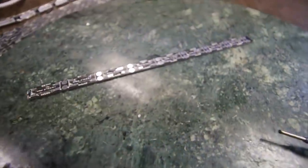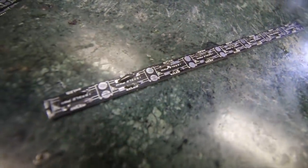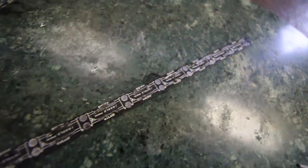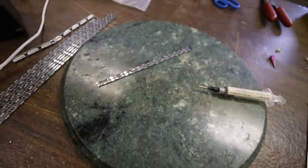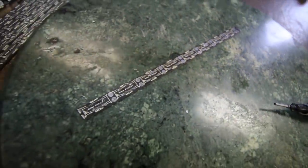You can't see super well — this isn't the best lens for fine detail — but I have these lines of solder paste on here. What's going to happen when it hits heat is it's just going to completely liquify and spread to everywhere it can attach to evenly. That means you don't have to be a perfectionist when you put it down — you just don't want to put too much. That thing is super hard to squeeze.